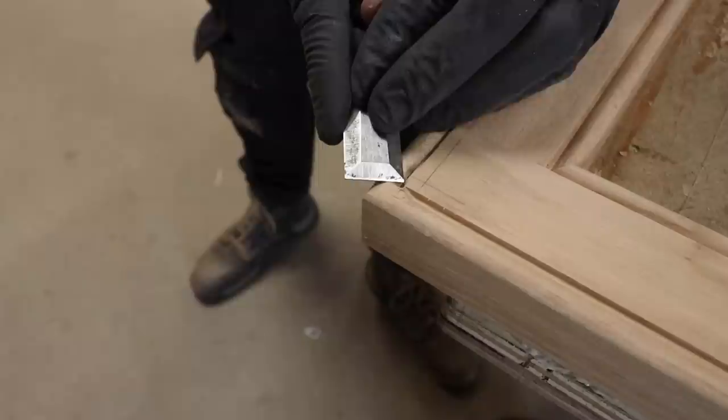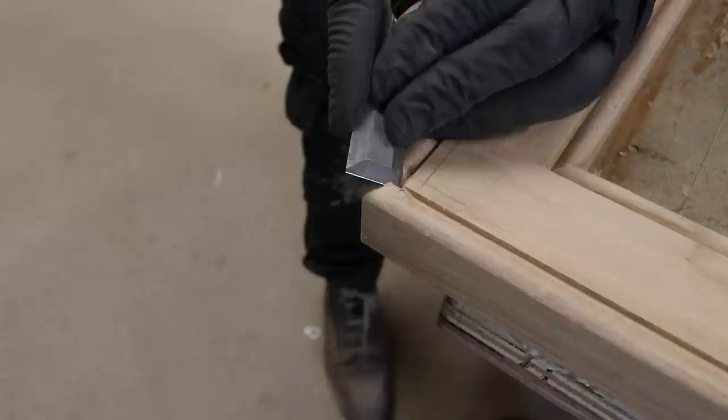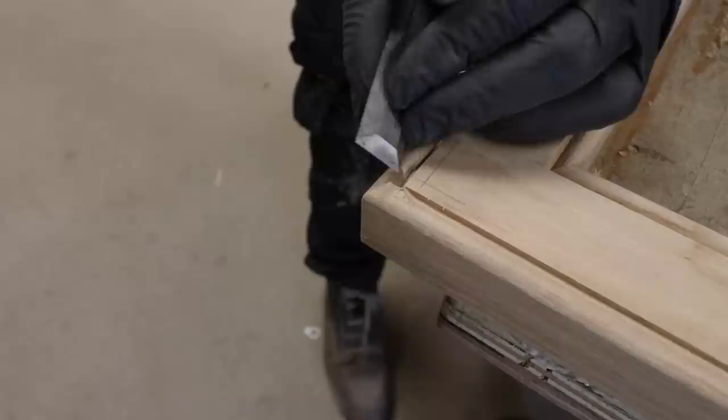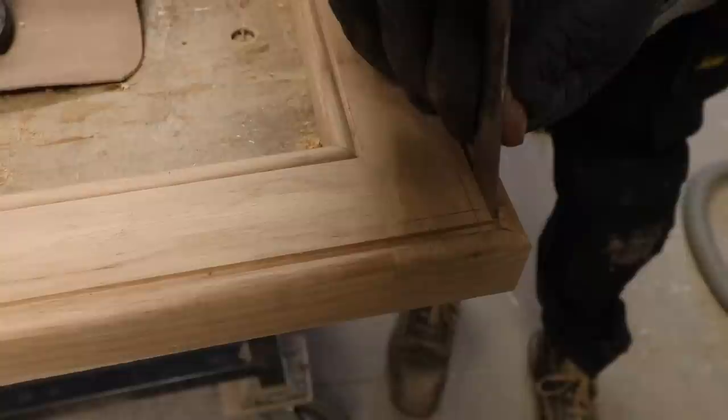Any sort of, well, letter carving that I've learnt. Well, I've not learnt letter carving. I've done a fair bit of it over the past few years. You never want to cut any deeper than your finished cut. Like I was saying with these mitre cuts here, it's a slice into the exact position you want to go to, no further. Especially if you're using a wood dye or something like that, any cuts into the timber are just going to show up nastily.